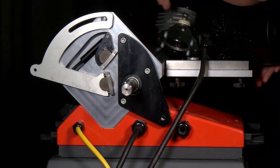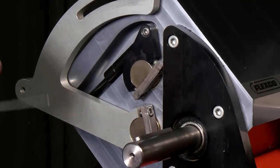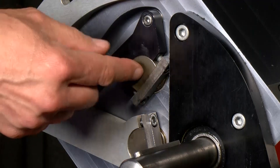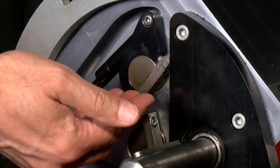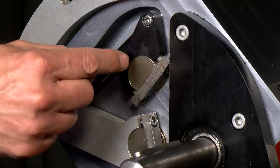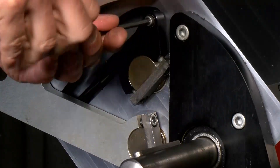You can rest the motor on the table carefully and proceed with making the adjustments. We need to bring the traction roller down closer to the blade, so we'll start with the top traction roller. The shaft for the top traction roller is on an eccentric — turning it one way or the other will either raise or lower that traction roller. To lower it closer to the blade, we're going to slightly turn this shaft clockwise. I'll start by removing the fixation screw, which is a 4mm.